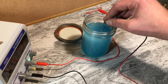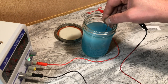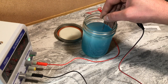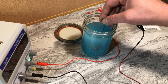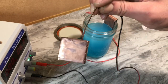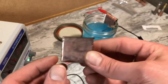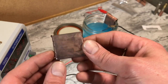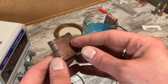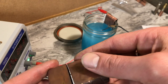You just got to move it around to get an even coat at the beginning, or else it's not going to plate everything very well. Move it around, make sure it's going all around the case — it's going to get it all. Don't touch the other one with this one, and it doesn't matter if you do, but just try not to. Alright guys, I'm going to keep this here for a while and I'll come back to you with the finished product. Alright everybody, we're ready for the last little bit of copper to come out. You got to just keep moving it around, making sure it's getting all the sides evenly — flipping it over — especially when you're using a jar as small as mine. Let's take a look how she looks. Oh, that's pretty sweet! Man, I'm impressed with that. That looks nice. It looks dark here, but you can see it's still a mirror finish — still a copper mirror finish. You can see the reflection, but there is that little bit of burn you are seeing through, but I'm fine with that — this is my antique copper right here.